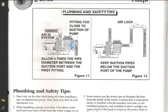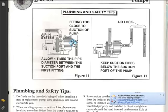Besides that, when pumps do overheat a little bit, this male adapter that you screwed in loosens up all the time, and you can cavitate and suck air — it will rather suck air than suck water. So a lot of times, this is your main culprit too. When I was out in the field, I used to go to Ace — Ace used to sell it, now I have to go to West Marine — and I bought clear marine silicone. I squeezed it and put it in the threads and threaded it into the pumps, nice and tight, and let it dry. After four years, I never had pumps that leaked.